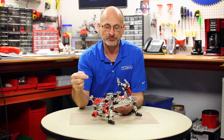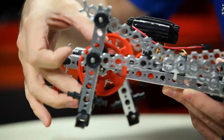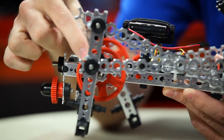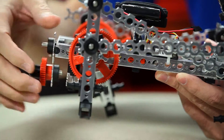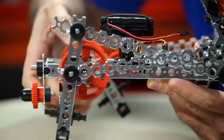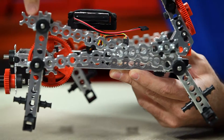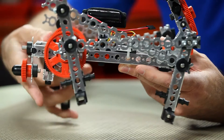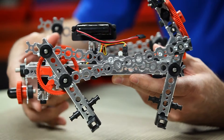Well, we're doing that just in the opposite. I've got rotational motion in the back here through one motor. And because I've got on my motor a basic cam operation, I'm changing the rotational motion here into a linear motion back and forth. And because this leg is mounted on that cam, I've got kind of a complex motion going on here. I'm going to rotate this around so you can see. I've got two linkages of unequal length attached to two different points on my legs. As I rotate that around, I'm getting not only a back and forth motion, but I'm also getting a little bit of a vertical motion in that back leg. And all of that's combining to make a walking mechanism.